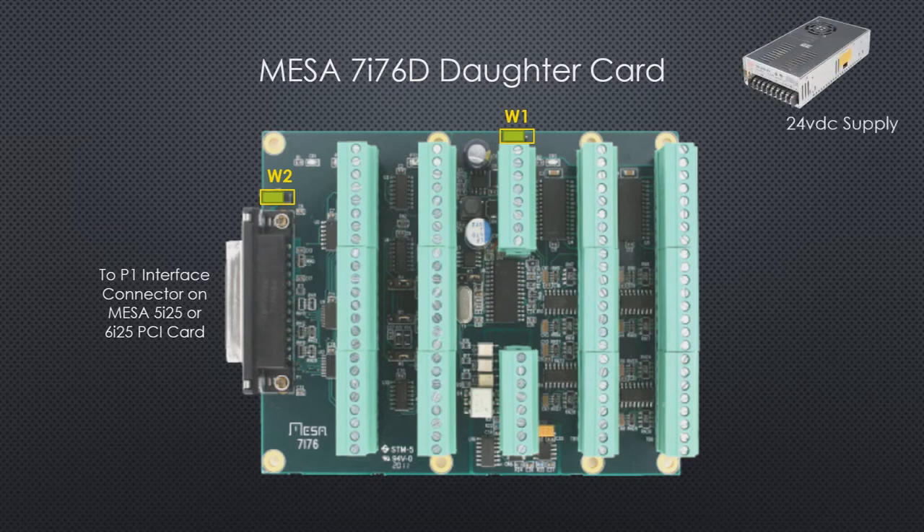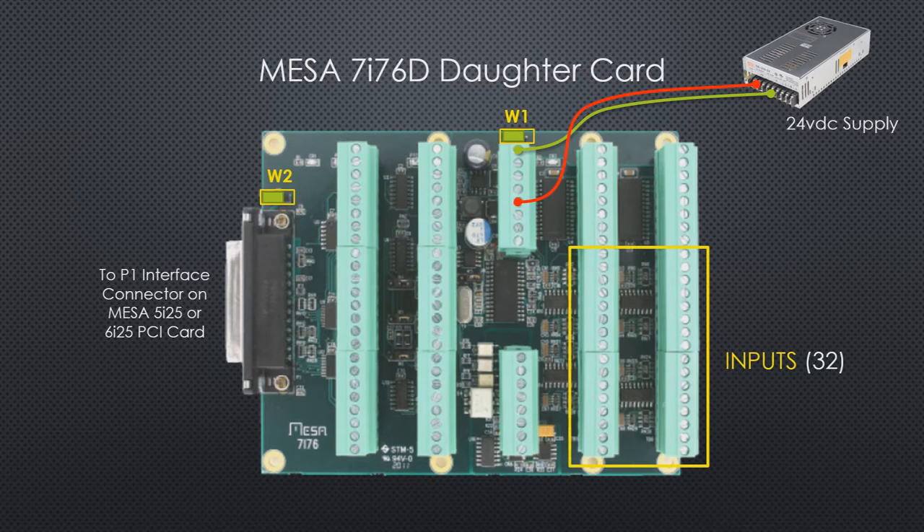The card has some serial connectivity and additional chips, plus an onboard power supply. It needs a 12 to 24 volt supply to operate. I like to use a 24 volt power supply because I can also use it for a couple of my smaller steppers. You connect 24 volts to one of the 24 volt input pins and connect ground to the ground pin — at that point it has all the power it needs. The card has 32 input pins in total and 16 outputs, which is a lot more I/O than a parallel port, so this board is really good if you want additional I/O.